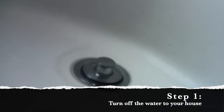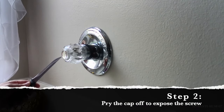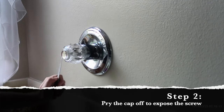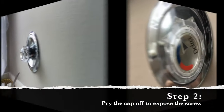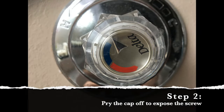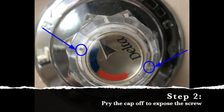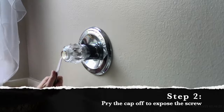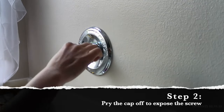Before you start working in your bathtub, make sure you either close your drain or put something over the top of it so nothing falls down there. In order to take off the handle you're going to have to get access to the little screw that's underneath the cap. Here's a close-up of the bathtub handle — I'm sticking a pokey object into these two little notches so I can pry that little cap off. It can be a little stubborn, so keep prying a little bit at a time until it pops off.